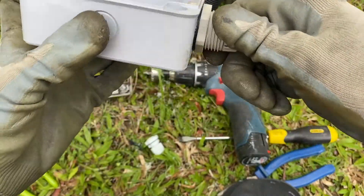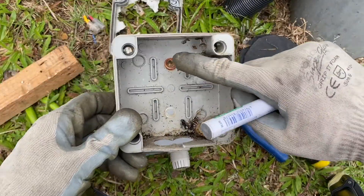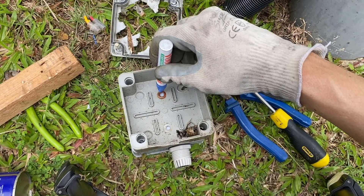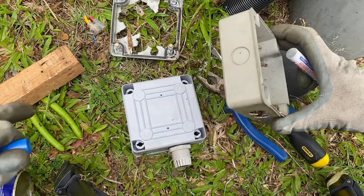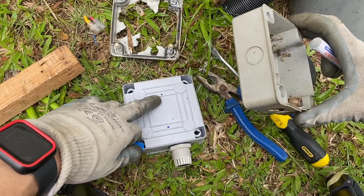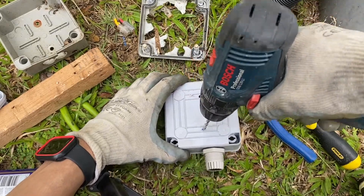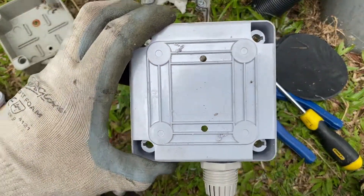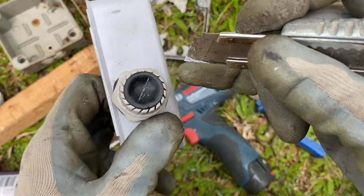Next I'm going to find out where the M5 mounting screws go, so I'll mark the position using a marker pen — there you go, one, two. Then I'm going to drill using the M5 drill bit to get two holes for the M5 mounting screws.